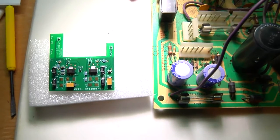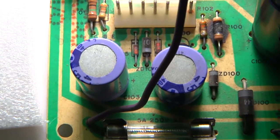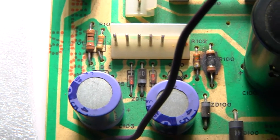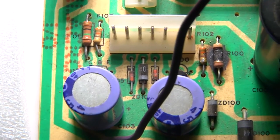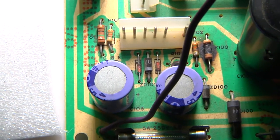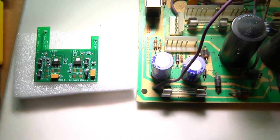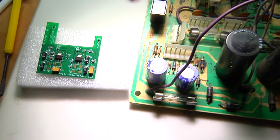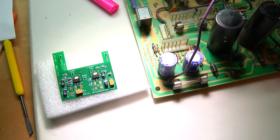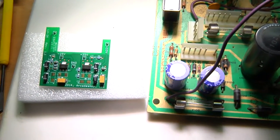Here's the LV2K kit — I think they released it in 2014. This is what is going to be replaced: all the components you see right above that fuse, pretty much all of them except for the connector. This is a very important replacement. All these parts fail and this monitor just wasn't designed very well. No offense — it's beautiful when you have these working. These color vectors are just gorgeous. You've got Star Wars, Space Duel, Gravatar, Tempest, Quantum, Major Havoc. I love the color vector games. I think a lot of collectors really cherish their vectors, but they're a pain to keep running.